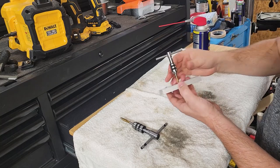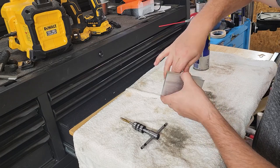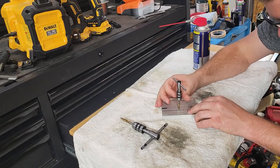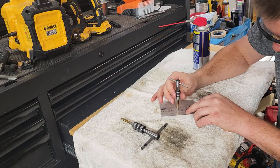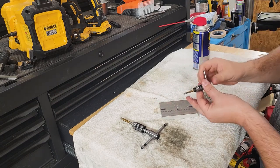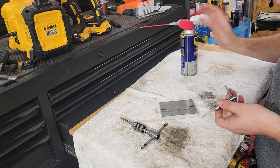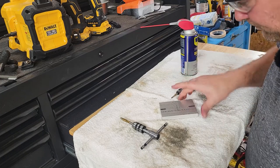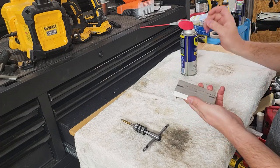I'm trying to keep the tap as even and level as possible when taking it out, especially for the last thread — you want to make sure it's nice and clean because that's your starting thread. So now I have a dirty tap. You can take your oil, spray a little bit on the tap — look at that, it cleans right off. That's why I use shop towels: they capture a lot of those metal filings. You can shake them out in the yard or eventually throw away the towel. One hole completely threaded — looks beautiful. Let's do the next one.